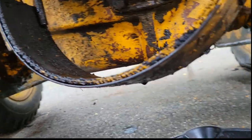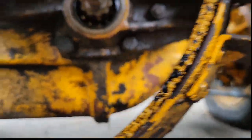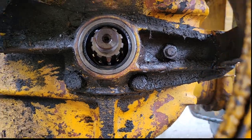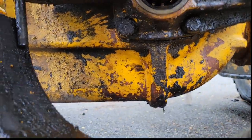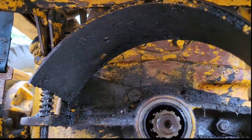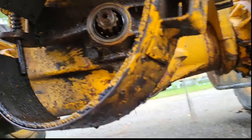I'm going to be addressing this brake band — it's mostly okay, however I'm getting close to a rivet up on the top where there was some wear. With all the oil slopping on this thing, even though the band is fine and it squeezes, with that much lubrication it wasn't doing a whole lot. I'll probably power wash but I don't want to do it while that's open. I'll get the new seal in, clean this up, make sure the drum is good and dry. We'll be replacing this brake band.